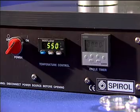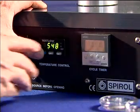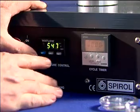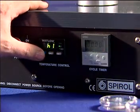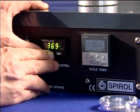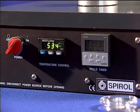Two: it has an easily adjustable temperature setting for optimum melt and flow of the material during the installation process. The temperature is initially set based on the properties of the material to be melted. Subsequent fine-tuning can be easily accomplished after reviewing the melt and flow by sectioning an example. An additional feature is the high-low temperature lockout — if the required temperature has not been achieved or has exceeded the setting, the machine will not function until the readings are correct.